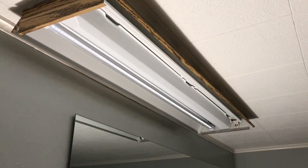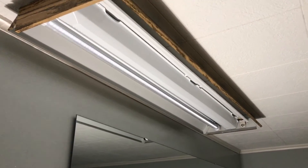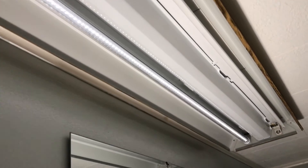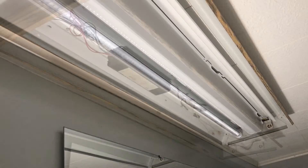These can work with the ballast or you can rewire and use without a ballast, which is what I had to do because my ballast was going bad and that's why my fluorescents were blinking. I thought it was the bulbs, but it wasn't. I just went straight away, took out my old tubes, popped in the LED tube, and saw it was still blinking — that told me my ballast was bad.